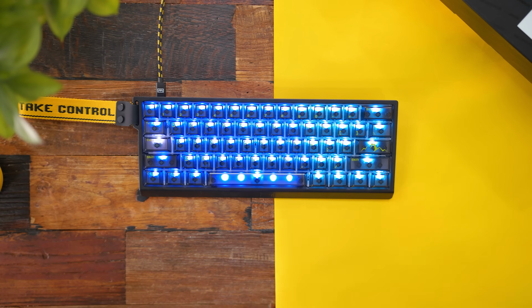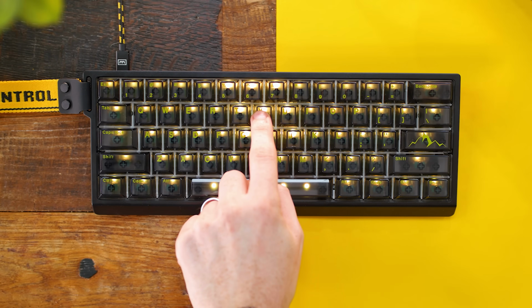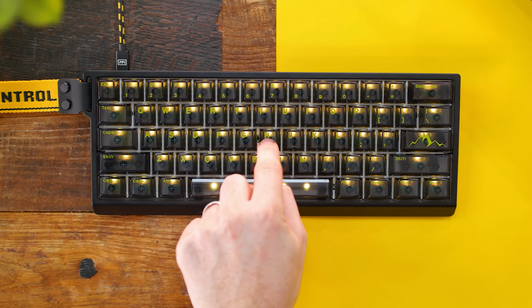This is all on a per key basis as well. So your WASD keys, for example, say you want them super light, they can actuate at 1 millimeter or less, and then other keys can be at 2 millimeters so you don't accidentally press them. And then now you can have these micro movements per key with absolute precision. And that's ideal for, like, in-game strafing, for example.